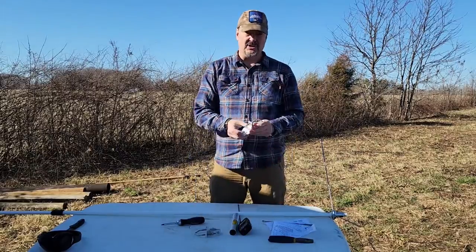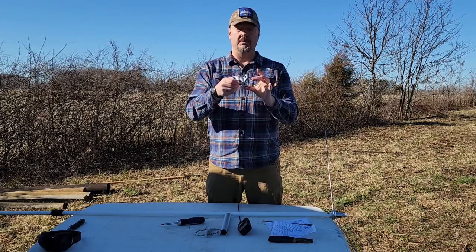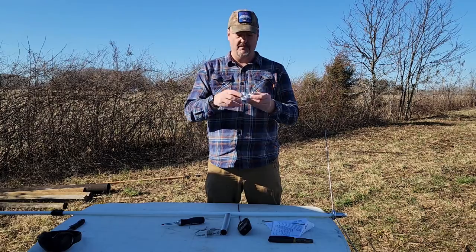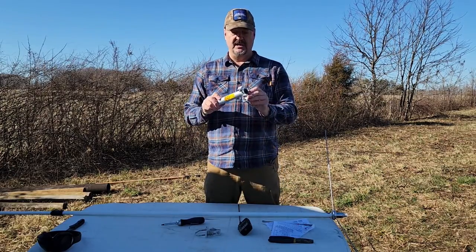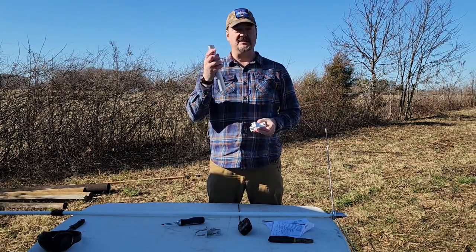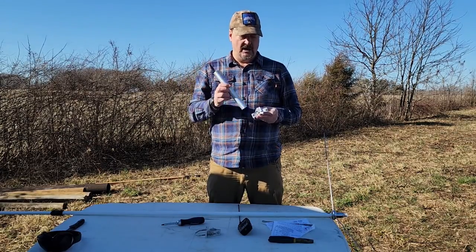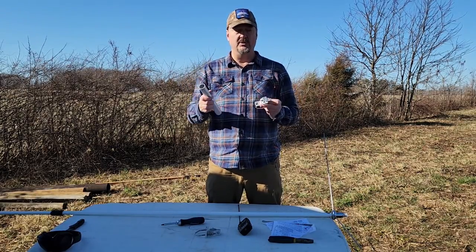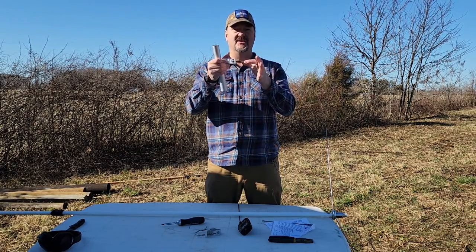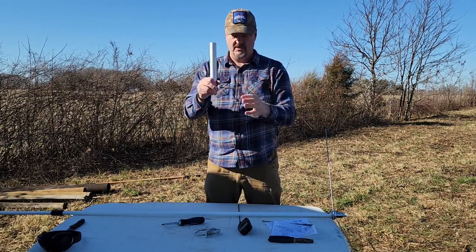So the next thing to do is to put these brackets into these mounting U-brackets, to these guys. Now, these fit into the collar here, this protective collar that we're going to put on the bottom of the antenna. This is to protect the cable connection to the antenna from the elements. And so it just fits just like that, and there'll be two of these, and then these brackets, or the U-joint that you've got here, is going to attach to the mast like this. So you'll have this sticking up plus your antenna on top, and then these will help affix to your mast.